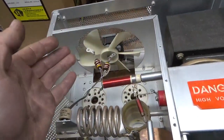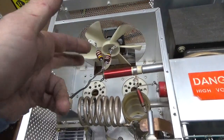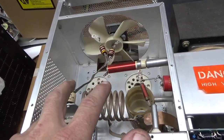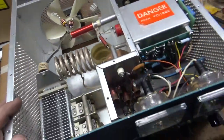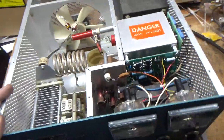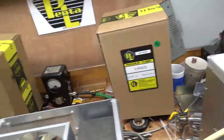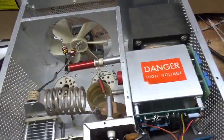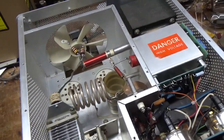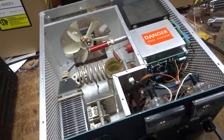The fan's sufficient. The fan cools not only the top of the RF compartment, but it also cools the bottom of the sockets. It's very important to have cooling at the base of the sockets — otherwise the pins will overheat and the solder will drip out. I'm going to flip it over and show you the bottom. It got a set of Penta Labs tubes — great company, awesome customer service over there.